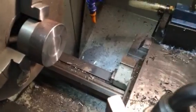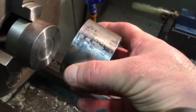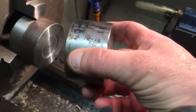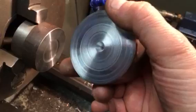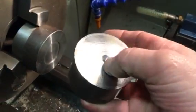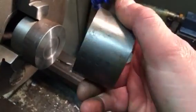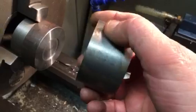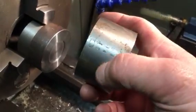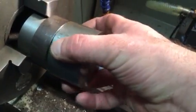Today what I'm going to do is I've got this piece of stock here which just came out of my scrap bin, and I'm going to make a handle out of it. I've faced it off on both sides — it's not to a known length yet — but there are some nasty marks on the outside from where I've obviously held it in a four-jaw chuck, some real nasty dings and dents. I'm going to put it in against this pressure pad.